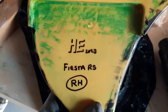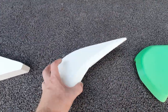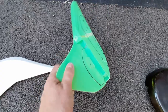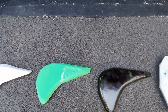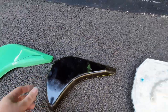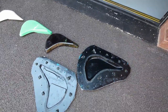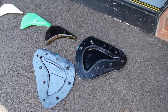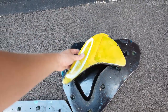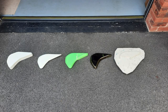Then need to go and clean these up, put a part number and a label on that buck for the right-hand end plate. It's been a heck of a journey - starting out with handcrafted foam, digitizing and 3D printing that into a model to check the interfaces with the other parts of the spoiler assembly, then producing the final part which was gloss coated, waxed and coated in release agent ready to be turned into the final mold. Here we have it - a two-side mold that needs polishing and cleaning up. I'm really taking my time over this because I want to get it right. For some reason I couldn't work out why the left-hand side wouldn't fit in the right, and then my brain twigged - so there we go, can't always get it right! Thanks very much for watching guys, and until next time, engineer out.